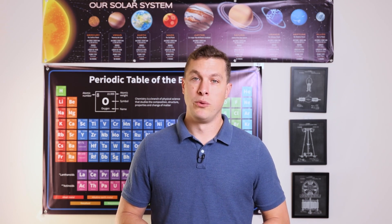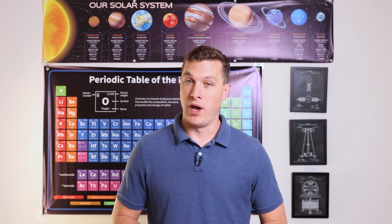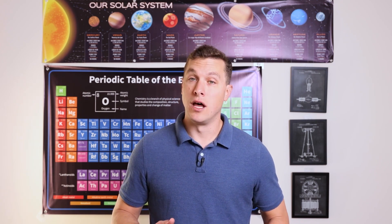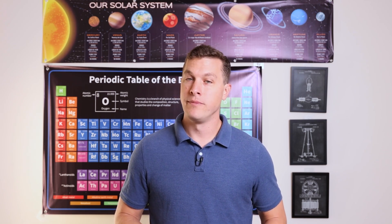Why was that? Well, it turns out that we used to wire those electrical light bulbs with something called a series circuit, and that has only one pathway through all of those light bulbs. So if you break it at one point, none of them work. More modern strings of lights use parallel circuits, and these circuits create multiple paths to every single light bulb. So if one goes out, the rest can still work, which is pretty sweet.